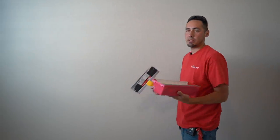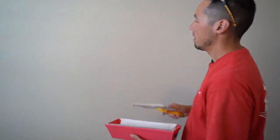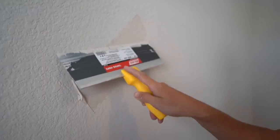We've got 45 minutes to work with this stuff, which gives us plenty of time. Essentially what I'm trying to do is fill in all of that knockdown — just put it on, glide over it, and push that material into all those little voids. We're going to do that across this wall two times, float it out really nice, then sand it down super smooth. Just off that first little section you can already see how flat it is, especially against the natural light coming in.